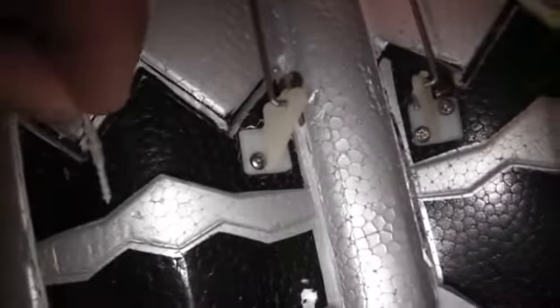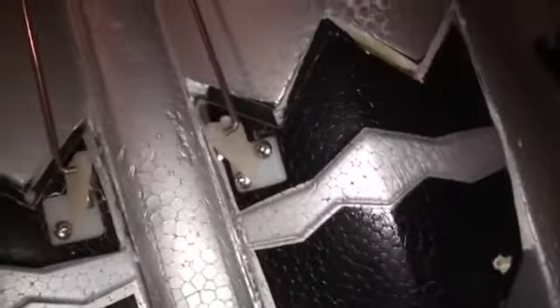So those two points are hinged — same thing on that side — and then I'm just using one servo, soldered together to the side. You could use two servos also; I just went with one because I didn't want to add too much weight to the tail end of it. It works pretty fine with one servo and it's basically just connected like a biplane aileron.